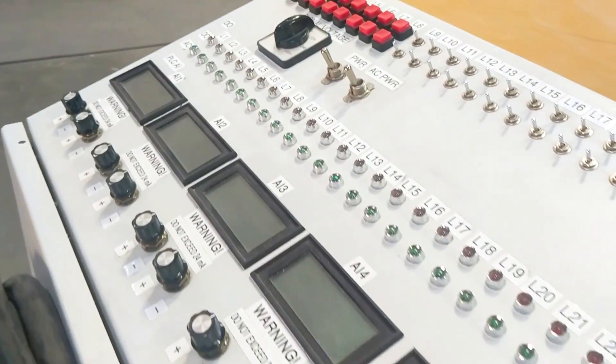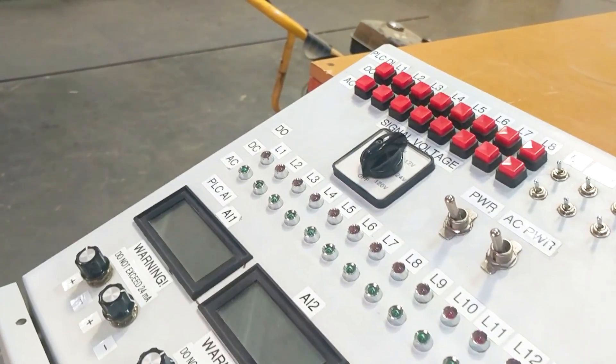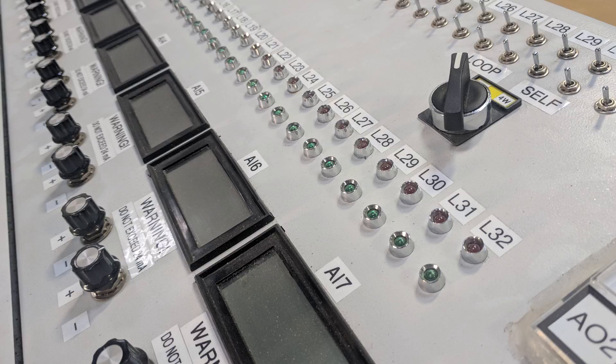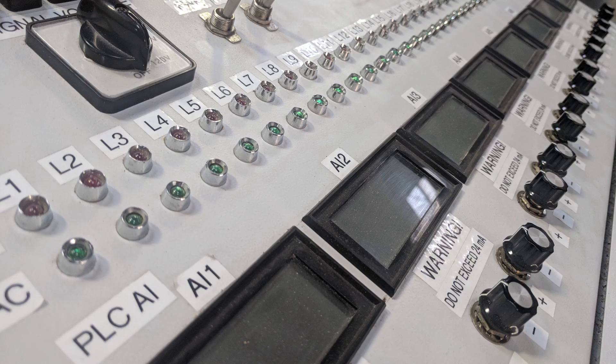We like to check voltage at each of these devices and make sure we're seeing what we anticipate, then we move on to AC power distribution. AC power distribution could potentially include your PLC and your power supply. DC power distribution covers all other hardware running on DC, such as your network switches, possibly your PLC, and some of your IO that may require DC power. So we're going to check all of the different types of hardware running on each of these types of power.